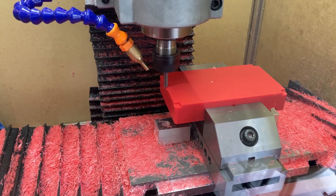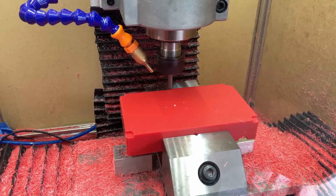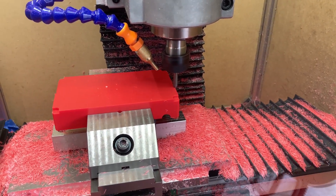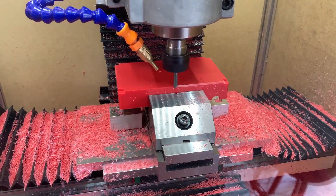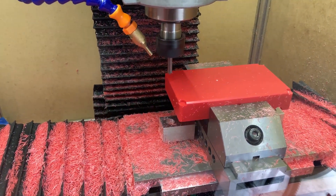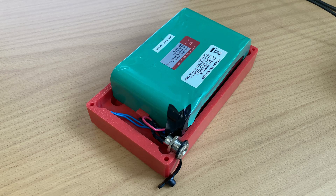Finally, I'm adding a pretty significant chamfer to the full perimeter so it feels nice in your hand. I'm leaving the original HDPE surface finish on top — it's a little textured and rough, which gives a bit of grip so it's not smooth on every side. I then ran essentially the same set of operations for the other half of the clamshell, with the DC jack mirrored.